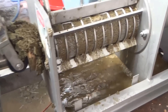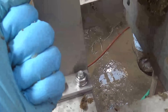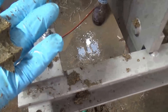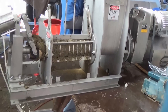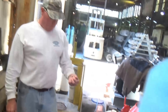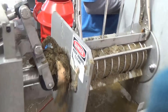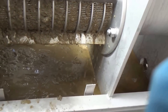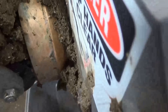We've added quite a bit of water. This cake — if I squeeze it — I can get a little moisture through my fingers. We're running a time test, labeled 1240 noontime. Getting a nice steady flow of cake out. Press liquor samples — the water seems pretty clear. We collect the samples. We're still running our tests.